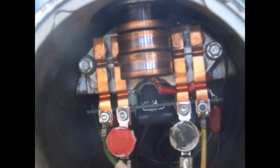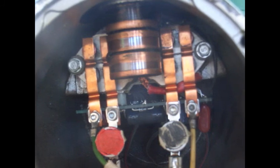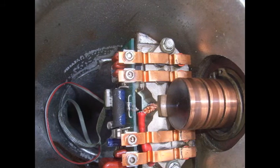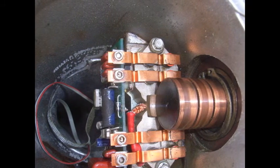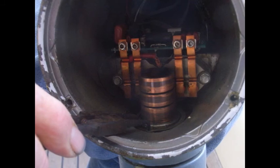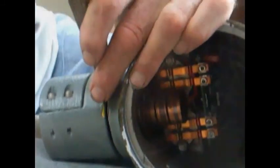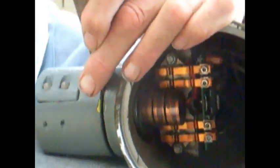Once down safely in the cockpit, disassembling started. We unscrewed the front — the face with coils came off. We marked left and right for positive and negative, then disconnected the electric wires and removed the face. The bottom bearing came visible, and the inside shaft snap ring was removed. Handy wood wedges were systematically wedged between the two parts of the windmill until it separated evenly.